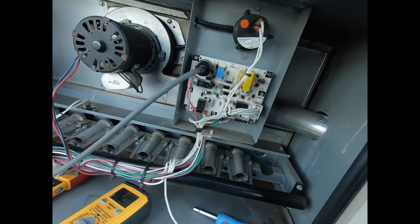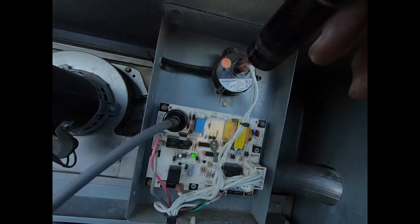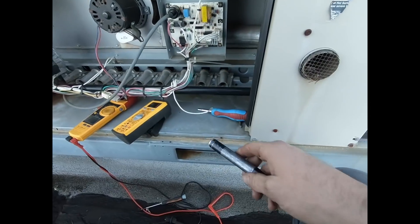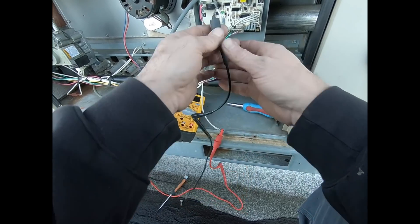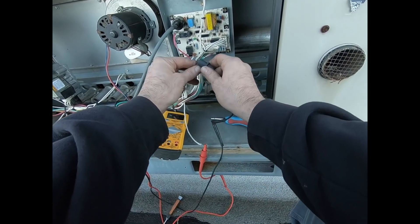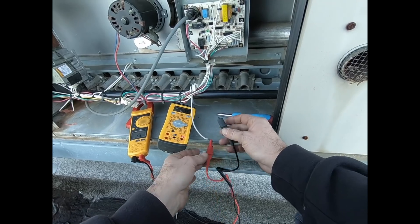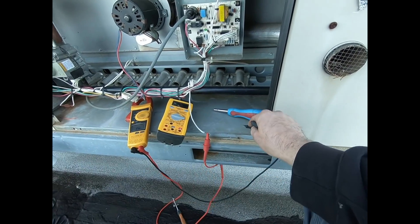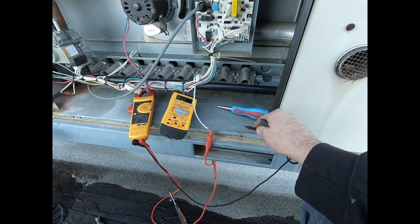Wait a second — I got some greenish color on that. A little bit of blue corrosion. Let's test this wire, both sides. Wire tests good. Regular test lead, let's go to ground, see if we're bleeding out to ground. No good — wire is not bleeding to ground.